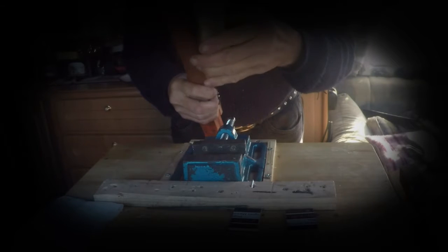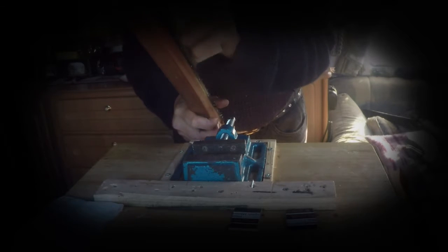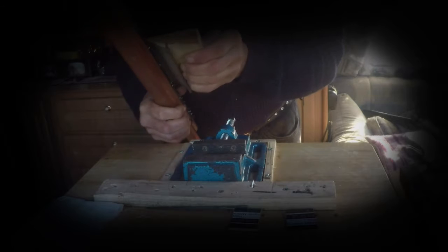That file, flat side onto your frets and gently rubbing, file all this nice and level. Okay, do that on both sides, and then when you've done that, turn it round to put your angle on, put that on there like that. That will give you a 45 degree bevel on your frets,